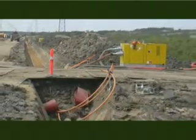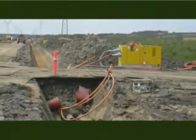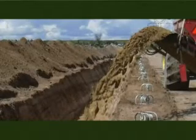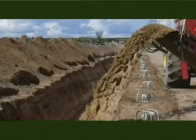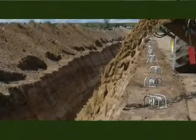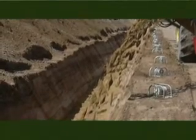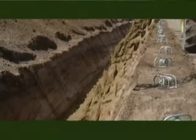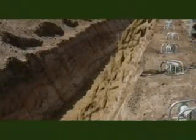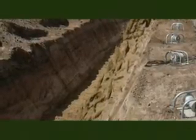water. Normally, the cable trench is excavated in the course of a day and the cable is laid the day after. Immediately after the cable is laid, it is covered with sand. The cable trench is approximately 1.5 metres deep. The bottom of the trench is filled with sand so that the cable lies approximately 1.2 metres below ground level, measured from the top of the cable.